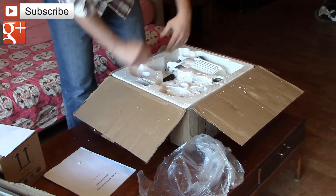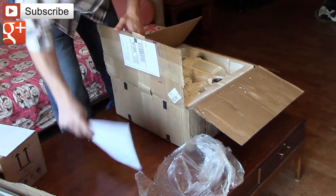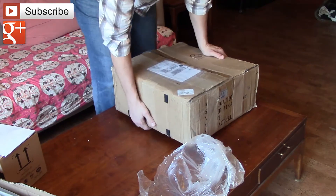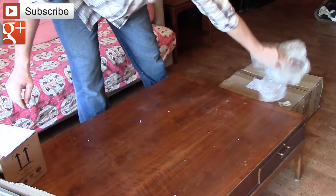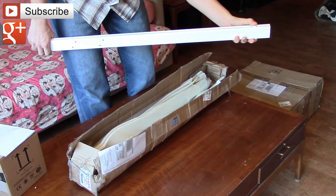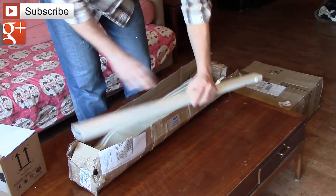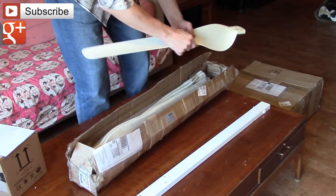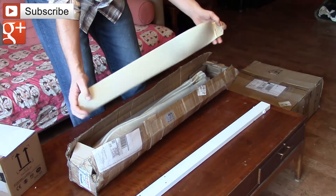Underneath all this — I'm not going to get it out right now — is the tail. So that's the motor. This is the furling tail piece, and it furls out when you get to a wind speed that's too high for the ratings on the generator. It's a five-blade wind turbine, and this is one of the five blades.